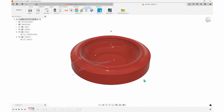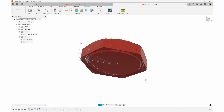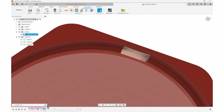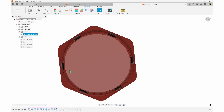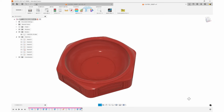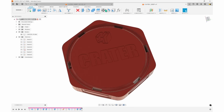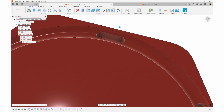The design process for this took me at least an entire day, and that's going to be about the same whether it's for a CNC machine or 3D printed, and it usually doesn't happen all at once — it's more of an evolution over time. The reason it takes so long is because it usually takes time to figure out the best way to make it function and also to be able to be 3D printed easily by anyone on any machine in any material. For the small CNC adjustments, I needed to adjust the bottom groove so a round nose cutter could come in, and the slots for the magnets need to be adjusted a little bit wider to match the radius of the router bit. I also removed the name and my logo from the bottom because I don't have any great way to machine that on the CNC at the moment.